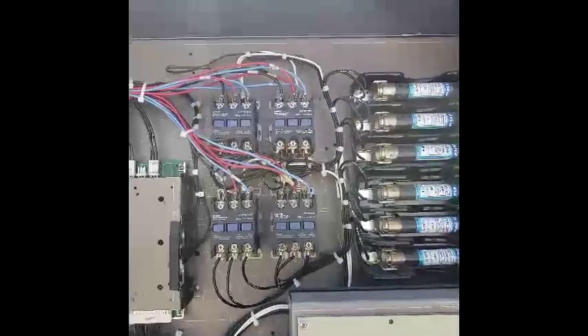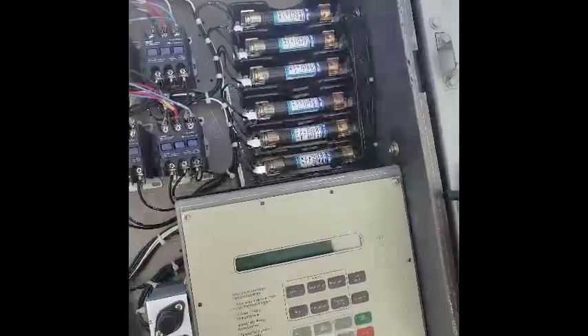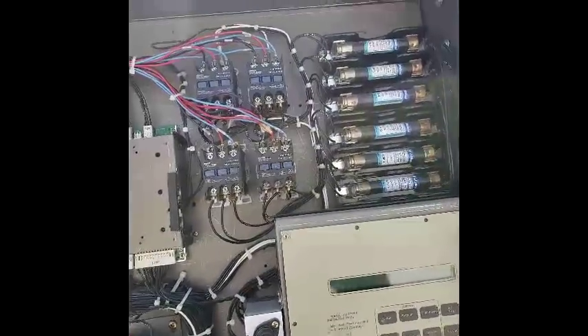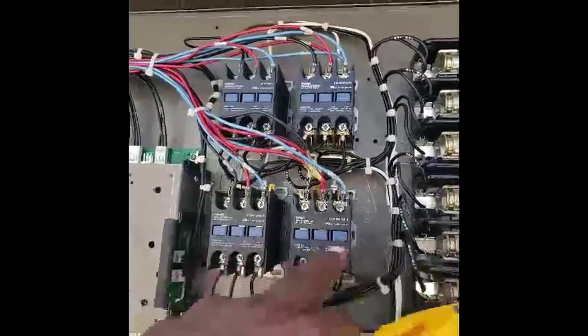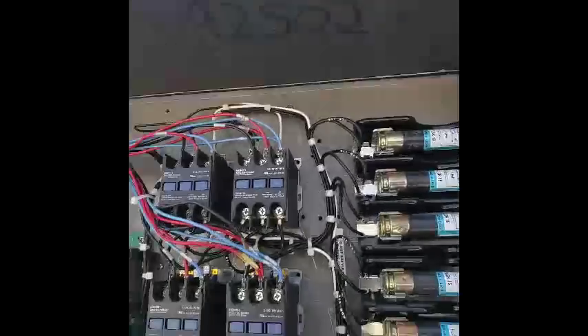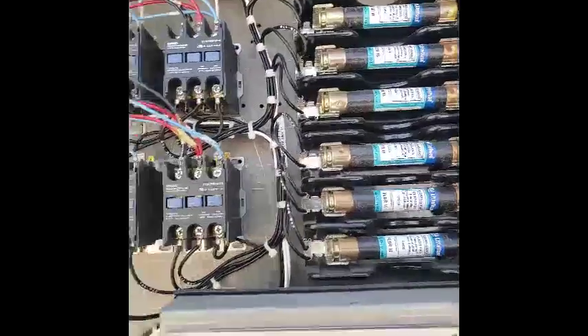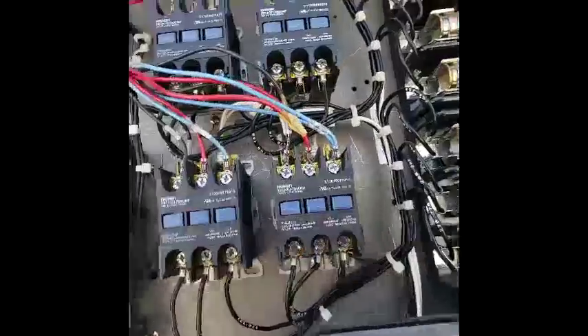This unit is going off on high head pressure. I found that these condenser fan contacts were engaging, but those two back ones wasn't coming on — I got on that ledge and I seen that the fans wasn't turning on. But these fuses are blown, and one of these fans is grounded.